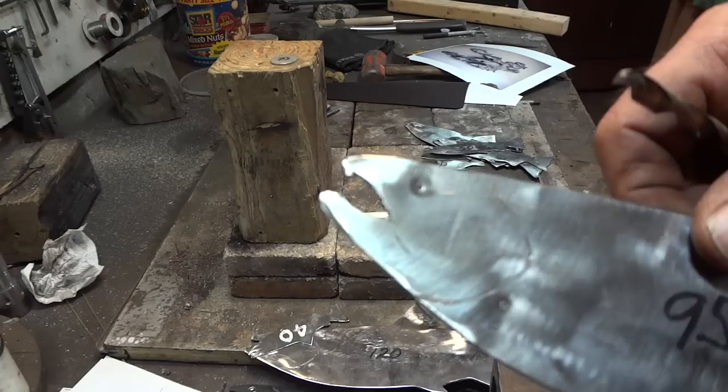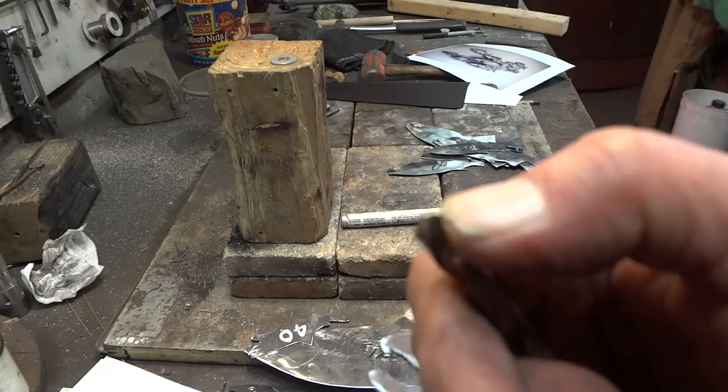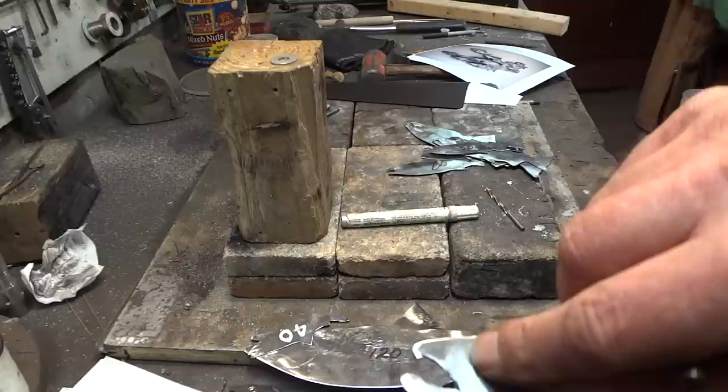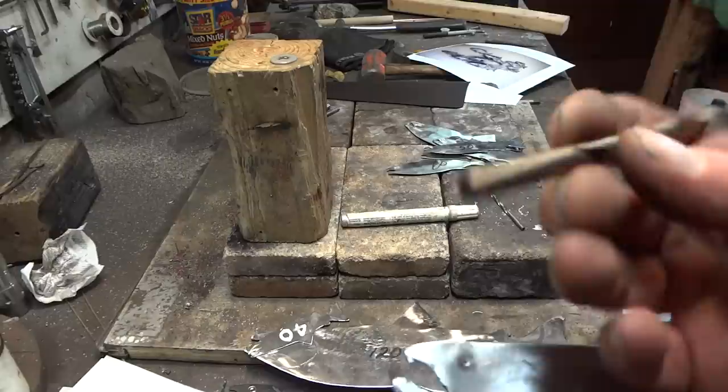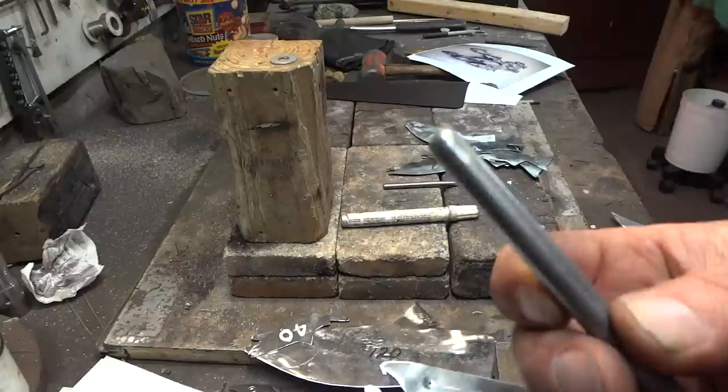The end of the drill bit is drilled at 135 degrees. If you punch this down a little too hard you can always punch it back with a hammer. You see how it's been punched in — now I want to drill through here just enough to create the outline of the outer edge of the drill bit. Because you've made that depression, the bit fits right in it. You don't want to drill too much — just thin the metal slightly and make sure you've got the outline of the drill bit on the outside of the eye, which defines the size of the eyeball.